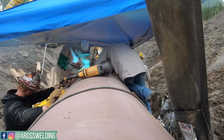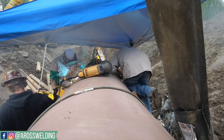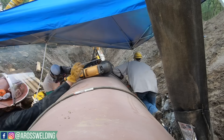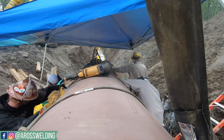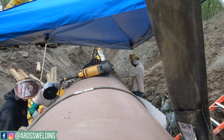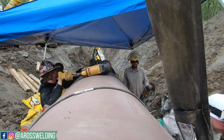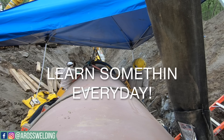I know it was hard to hear me talking over the water pump, side booms, and grinding, but a weld like that takes roughly four hours give or take, depending on the welder and how the bevels are laid back. Three bead cap, and we kept heat on it the whole time — especially if it's colder, definitely keep a little heat on it, make sure it stays up to 250 degrees or whatever the required temperature is. That's what we did the rest of the day. Hope you guys enjoyed it — thank you for watching, remember to learn something every day, we'll see you next Friday.